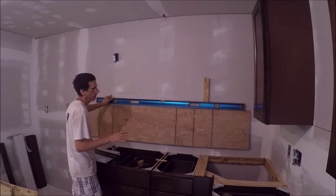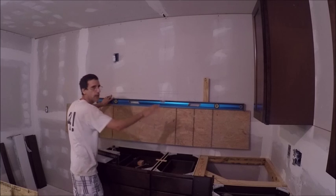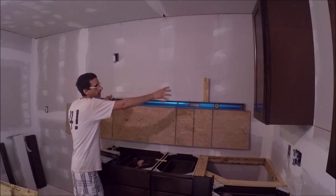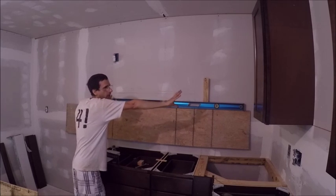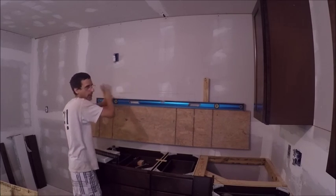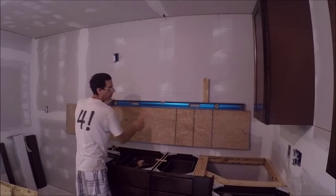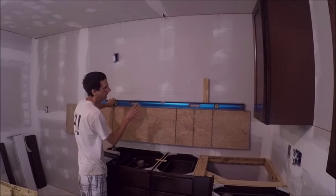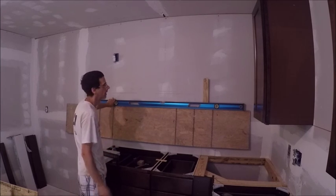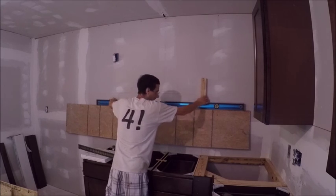So be careful. Make sure every cabinet you put on is touching this right here, and it doesn't go uphill and it's not at an angle. Like I said, if it is, you'll end up putting 6-8 feet of cabinet in, and those cabinets end up going uphill. So that's why I like to put a board. The reason this board's sticking out a little bit is because we still had some power and stuff in the wall that's pushing it out. Okay, so that's your cabinet.